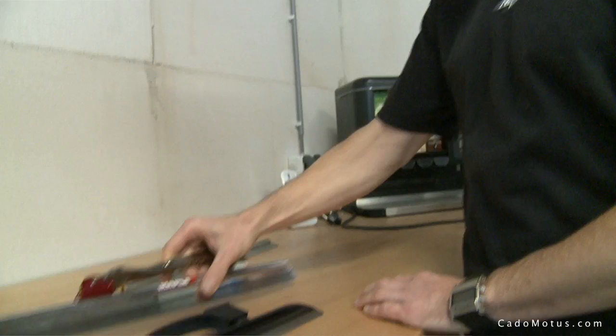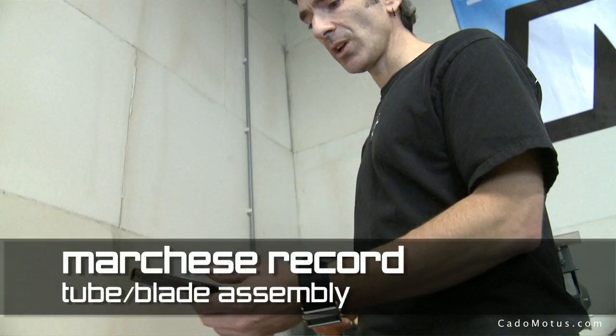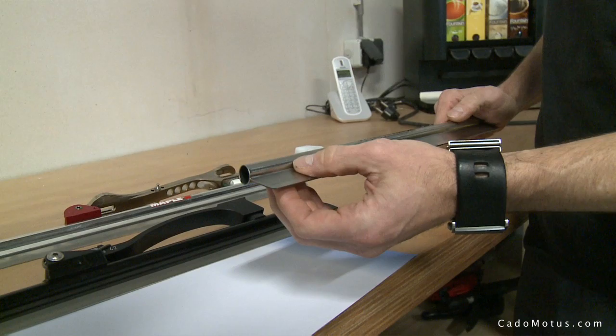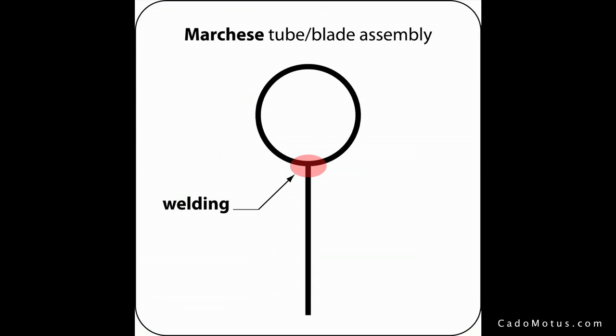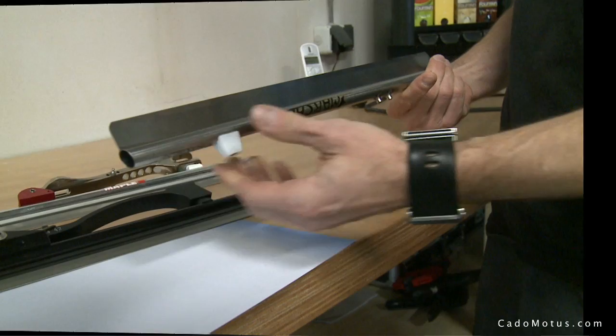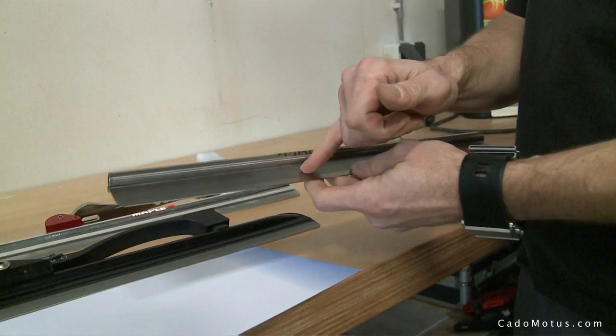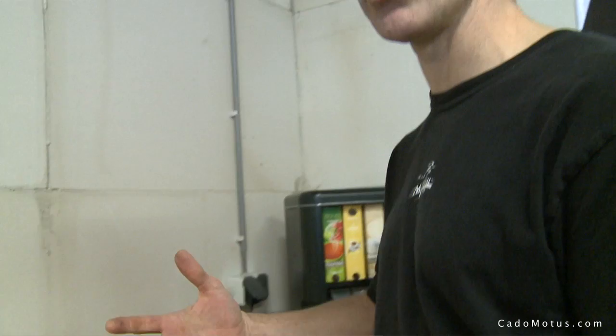So trying to take the best of both: this tube is fabricated as a very high quality aircraft grade steel tube — extremely thin wall, very stiff, very light. But using a completely different method of construction, this steel runner can be placed directly against the steel tube and laser welded. There's no flange; it doesn't need it. So it ends up lighter, and we can adjust the stiffness of this tube and the height and the stiffness of this runner to arrive at different feel and different grades of feel and stiffness on the ice, and give the skater a choice in what they want.